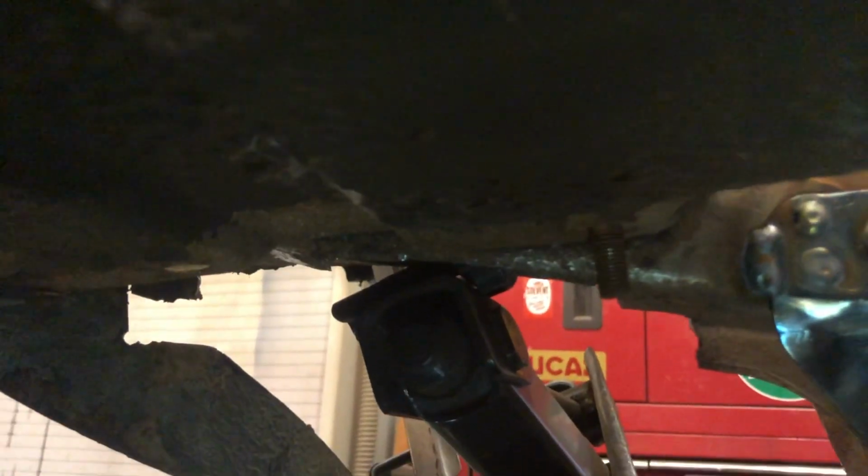Right, so I think what I'm going to do next is I'm going to take this jack off, get that spring out of the way, weld a few more plates onto this spring hanger. They're fairly simple, the ones that need to go on now. They just need to go one on this side, you can just see, or underneath, and one on the other side. So I'll weld this one underneath, check there's nothing else there to do, and I think then I'll paint the inside, and I'll leave it with one more plate to put on the side of it, and I'll get on with finishing that wheel arch you can see there. Right, onwards.